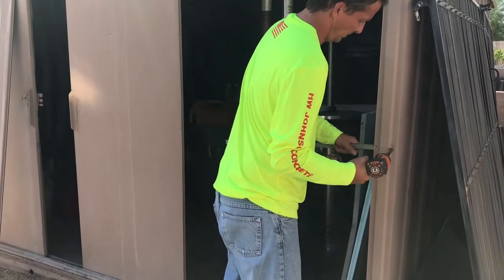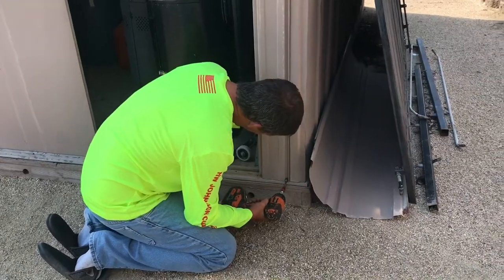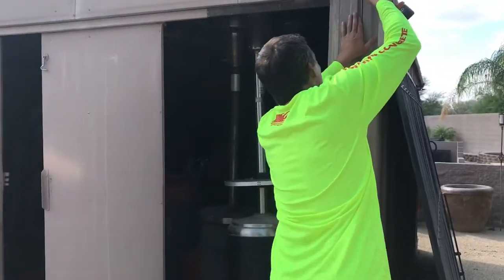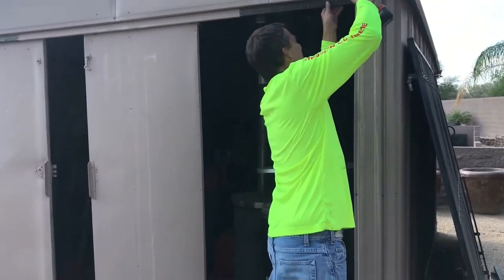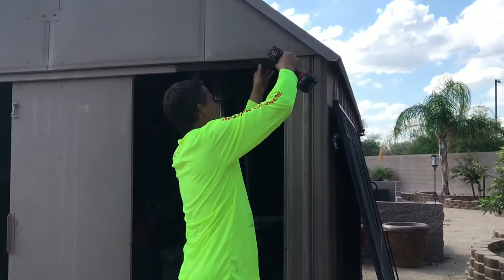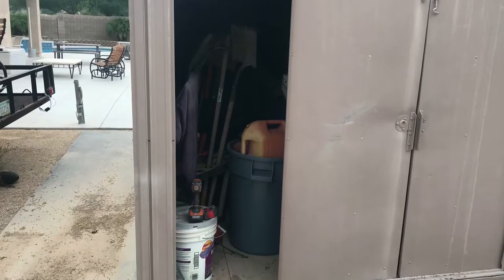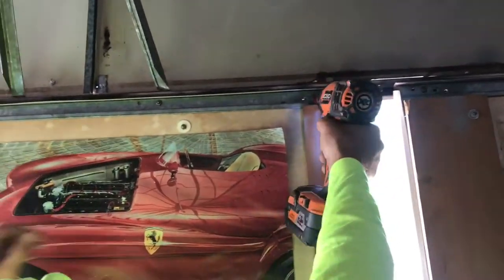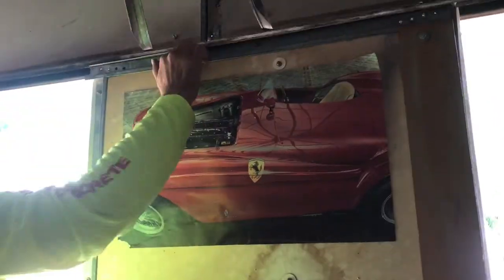I ended up using the skinnier piece of paneling I took off to extend the side of the shed a little bit, and went ahead and anchored it back into place on the top and the bottom. The only reason this worked is this shed is 10 feet wide, because you do still need a little bit of front paneling — probably 6 to 12 inches — just for structural reasons to support that bar that is over your door. I removed both doors and got those out of the way.